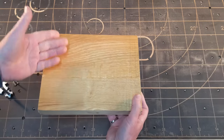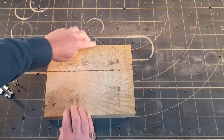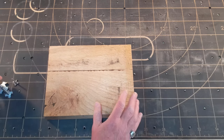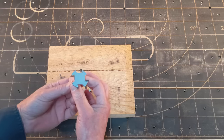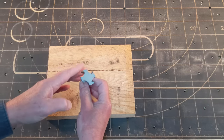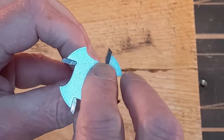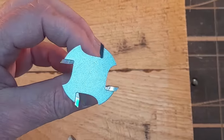We need to surface the rough side first so we can set it down flat, then surface the front side and proceed with whatever we're going to carve. Setting it down now, I can feel a little wobble back and forth. When thinking about our carve, we have to take into account something very important — surfacing bits. These are the IDC Woodcraft ultra smooth cutting surfacing bits. I redesigned these from the traditional three-flute surfacing bit, added a fourth flute, and fixed the grinds for a much smoother finish and faster feed rate.